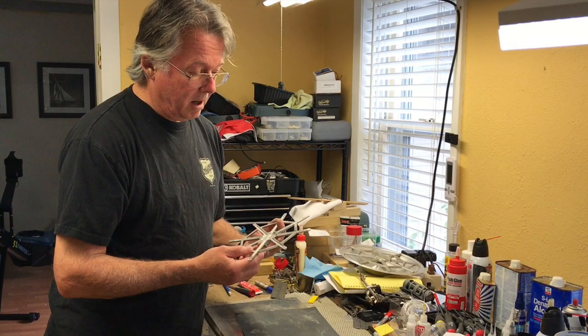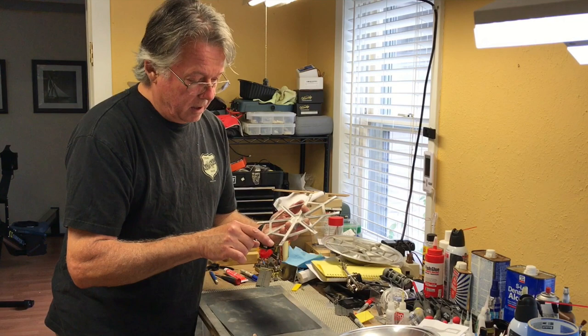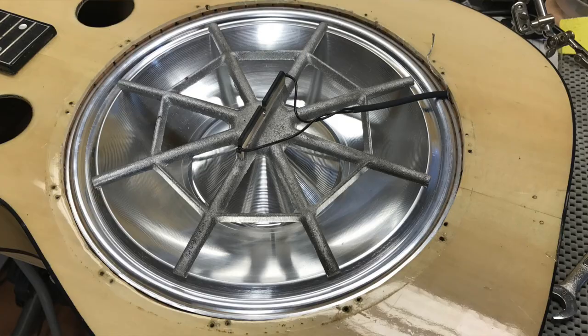I've carefully adjusted all the legs of the spider and I've been sanding it on 220 grit paper, and I have sanding marks — a little flat on each one of these legs. That means when we install it on the cone and installed in the dobro, everything will have uniform contact, and we can count on optimal tone for this cool dobro.